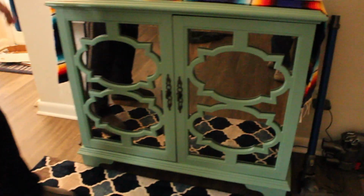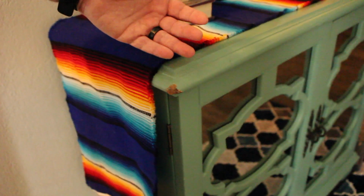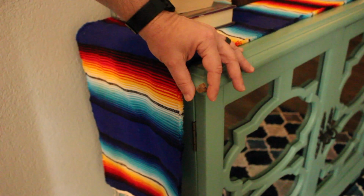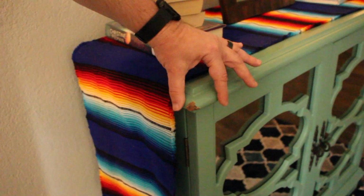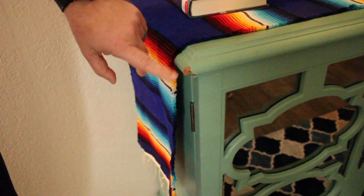And I don't remember how much this was purchased for. $55. Now, there is a small damage here. This is a very easy damage to fix. There is no piece missing, it's just that the paint is missing. So, if you plan to repaint it, and I don't think you do. I do. You do? If you plan to repaint it, simply use a little bit of wood putty or wood filler here, and with your finger make it, and we might make an episode for that, I don't know, make it just look the same. It does look the same already, it just looks like the paint finish on this. It's got a little roughness to it that I think the wood filler would smooth out, and so then it would make it ready for painting.